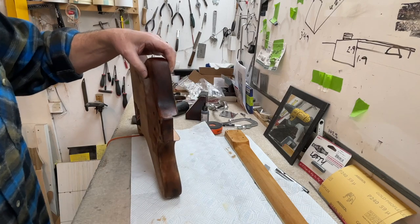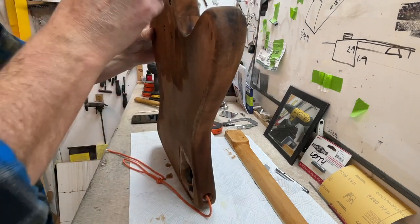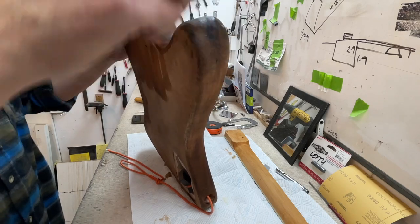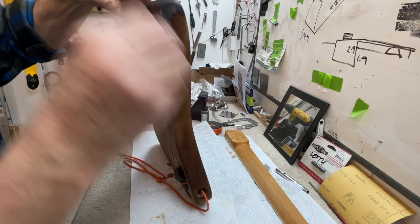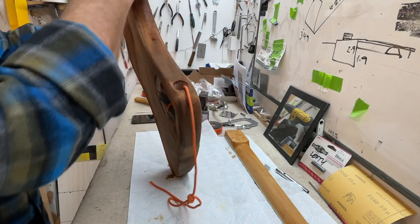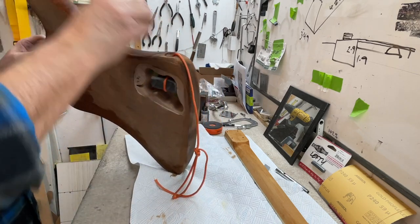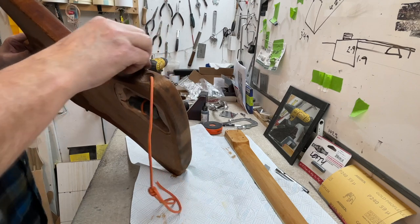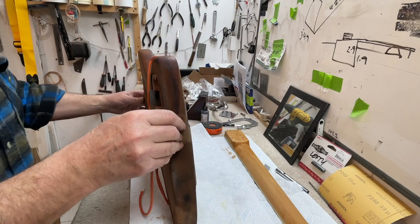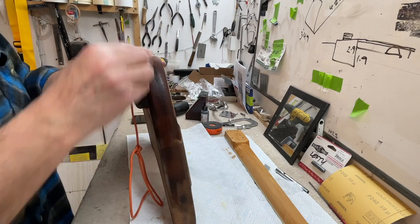And again, with everything, my only advice when you're doing this is just keep in mind that everything goes dark when you put the stain on. So everything looks disproportionately dark, and when you're doing it for the first time, you can suddenly go, oh my God, that's not what I'm aiming for, and get really panicked. But just bear in mind that it lightens up, and when you sand it, if and when you sand it, you can relieve it of its heavy colour each time, and then you can go back and build up more if you want.